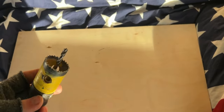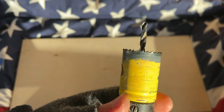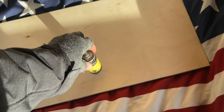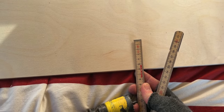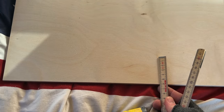Actually it looks really good. Let me show you. I'm taking a hole saw — I think it's called — and this one is 38 millimeters. What I'm doing is putting it around here. The measurement is quite simple: I decided that six centimeters from the edge is good enough for the center of the hole, and then I just measure out half of the length, and that's where I'm putting the hole.